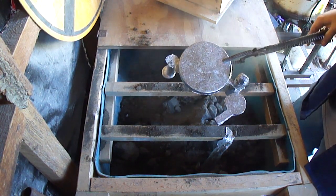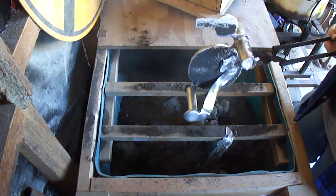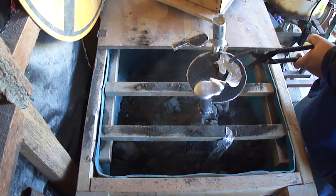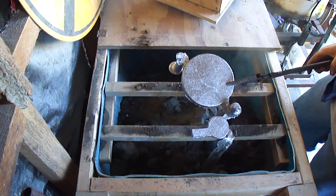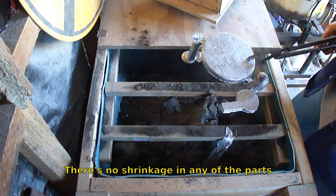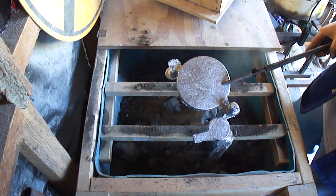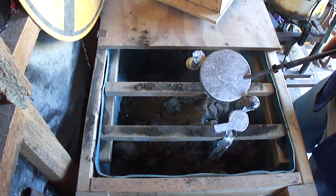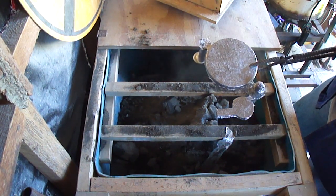Looks like everything turned out nice. The only last one I have is the brass worm gear blank, which I just poured, so it's pretty hot still with lots of steam coming off. Pretty much every casting today is a success — there's no real flashing on the disc or anything. I know there's a little bit here and there, but I did that on purpose because there's no good way to get your fingernails underneath the thing to lift it out, and I didn't want a screw hole in the back of the patterns. So each one will have a little flashing on each end.